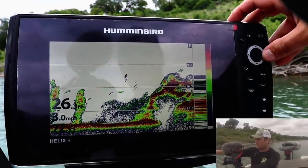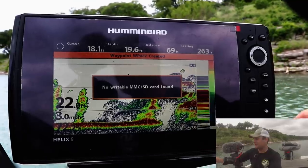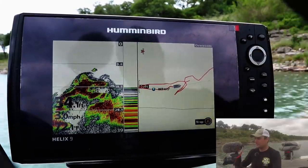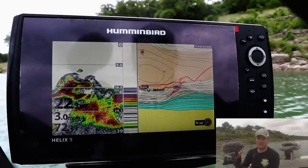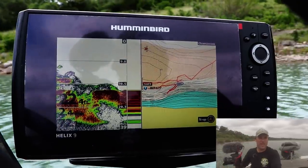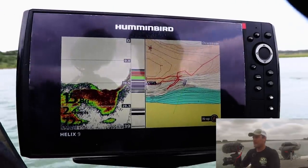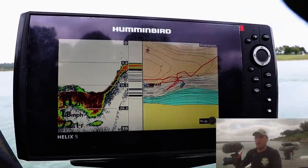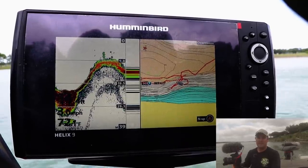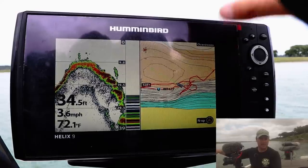The last thing I want to talk about — to answer where you are relative to your transducer — is marking a waypoint and going back to it. There's a big tree coming up and the creek bottom going up to the shelf. I'm going to mark this as a waypoint — hit mark. There's my waypoint. Now I'm going to go back to it — you can see the boat is heading straight away from it, so I'm going to spin around. I will say: if you have an external GPS puck, that is probably more accurate than just the internal GPS.